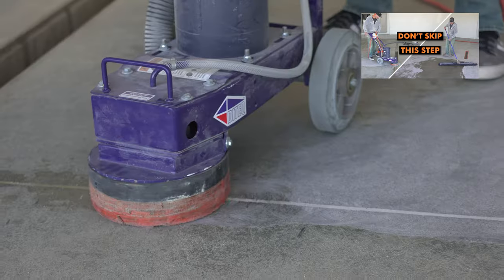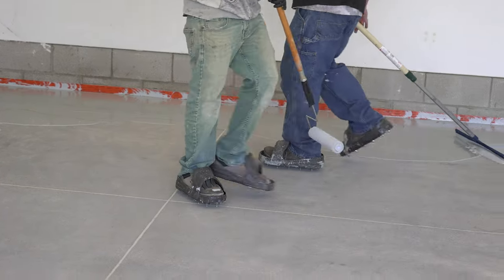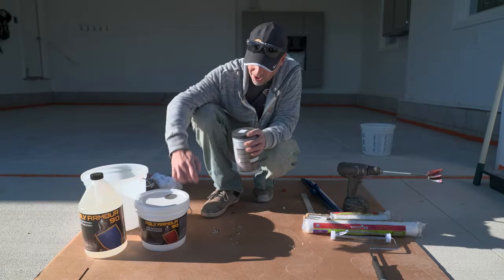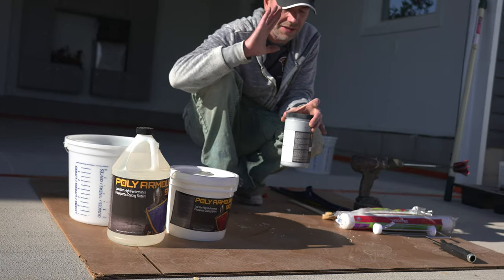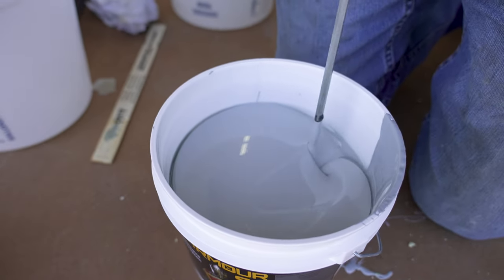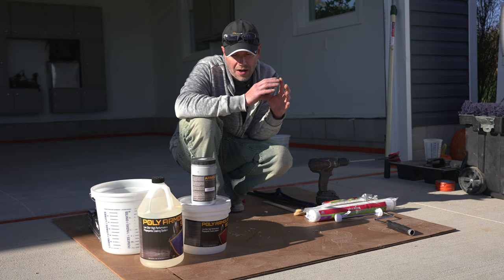We're all ready to go and it's time to start mixing. This first coat is going to have the pigment in it and we're going to chip right into that coat. There's a little extra step with short-fill kits — you get a gallon of part B and a bucket of part A that's only three-quarters full, leaving room to add the entire jar of pigment. I always recommend mixing the entire bottle into the part A of your short-fill kit. If you're newer to this or have tedious areas, just start with a gallon — you only get about 15 to 20 minutes to get this stuff out of the pail.